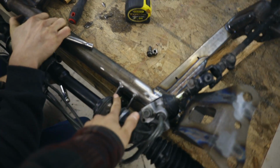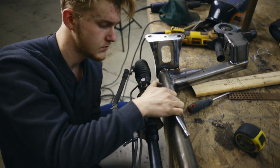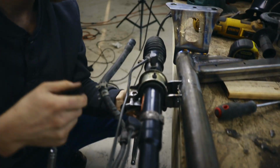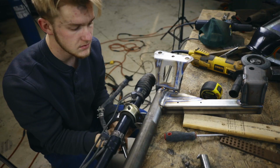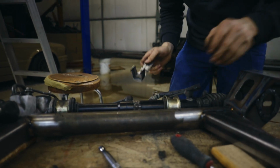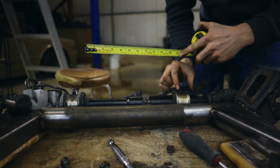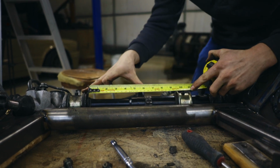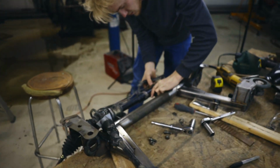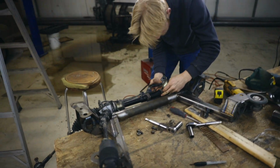Okay, so this mount is now welded in place, and we bolted the rack up to it, so it's sitting where that side needs to. Then we're bolting up the mount for the other side to the rack, and we're going to set it so that it's level with the subframe and then weld that side in. So we're just getting the final adjustment for where we want that mount. A little bit of tweaking, because we're going to scooch this mount over as far as we can so that there's not going to be any concern at all with the oil pan. Because again, the pan is 11 inches wide, which is right here. So if we can have this mount over even another half inch, we can probably get the pan centered in between these two mounts rather than having to completely cut them up and be losing that half inch. Yeah. So once we get that guy in place and weld that guy in, mounting is done, then just reinforcing a couple pieces, and then it's all done.